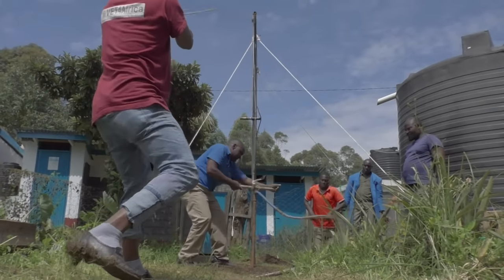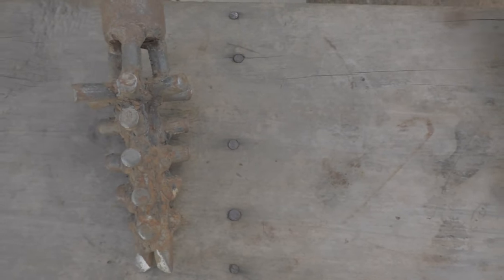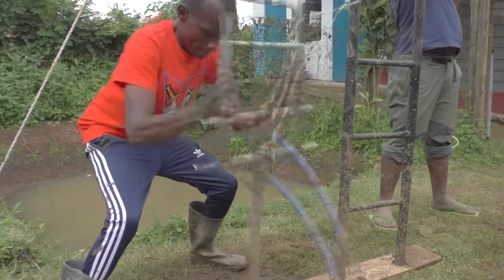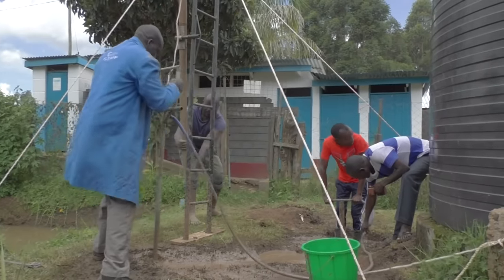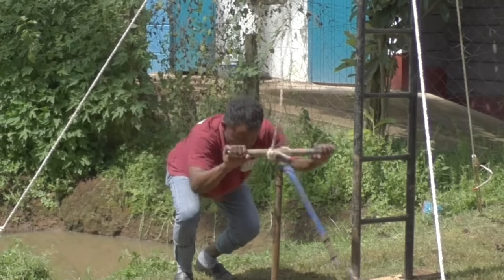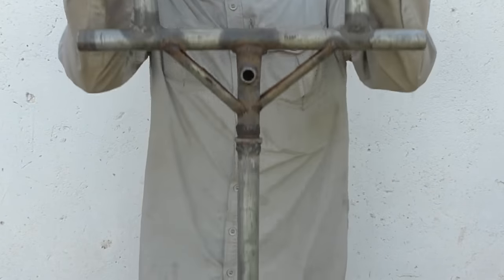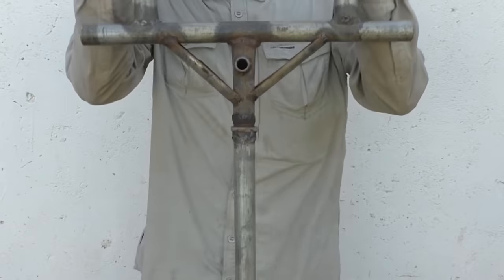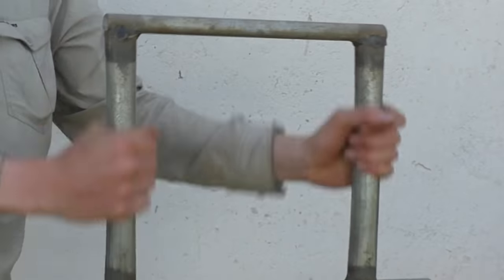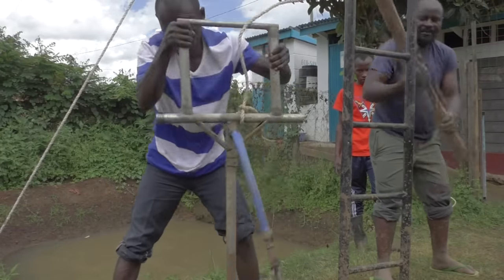In order to do this we need to make just a few adjustments. First of all we change the drill bit. The drill bit on the left, which we used until now, is symmetrical. Now we will switch to an asymmetrical drill bit. Because it is asymmetrical, the point of impact varies each time, and this helps break the rock apart. Also we change the handle, and this is the part I like best, because with a normal handle you have to endure quite some impact when hitting the rock, which is just not great for your wrist if you have to do it for a long time. To fix this, a handle is attached with vertical pipes which you can hold. Now if you hit something, your hands will slide slightly over the pipes, absorbing the impact. With the normal handle, stone punching is a very uncomfortable job, but with the stone handle it's much much better.